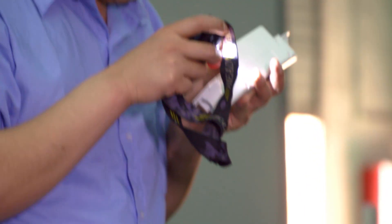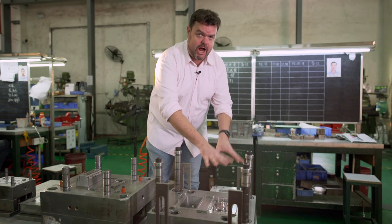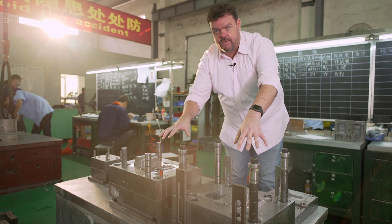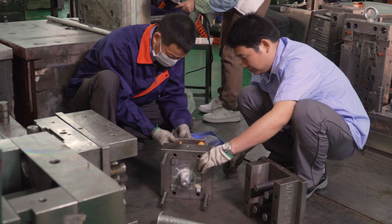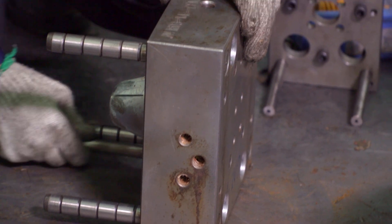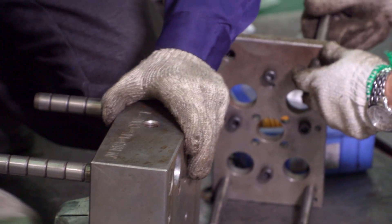Lastly, we offer high volume production tooling. These tools are made from hardened H13 steel or 420 stainless steel. These tools have a mold life of 250,000 to 1 million shots, sometimes more. The production tool has harder steel material and typically has multi-cavities, which means the production time is longer to machine and therefore the costs are also higher and the lead time for the tooling is the longest. But what is achieved is minimizing the part pricing.